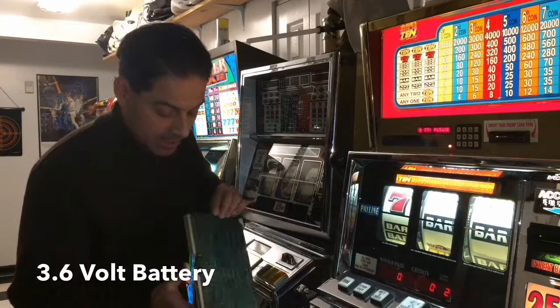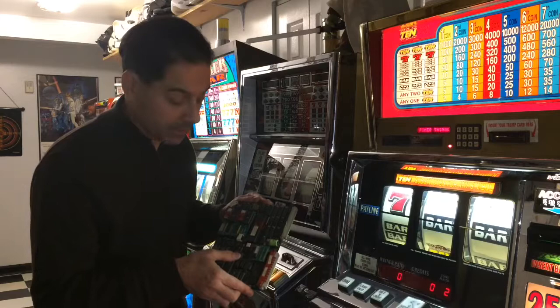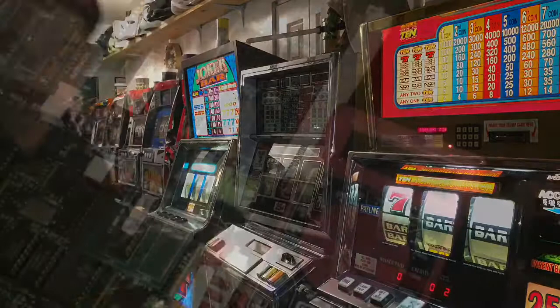You can see here's the battery right here — that's a 3.6 volt. As you can tell on the back, it's soldered through. There are three points and we have to desolder that so we can swap it out. But first we're going to test the voltage on it with our multimeter and see what the reading is to confirm that it needs to be changed out, and then we can start the process.